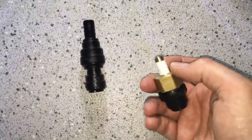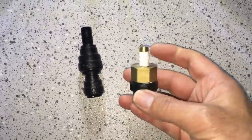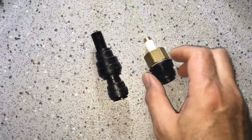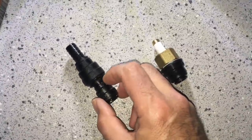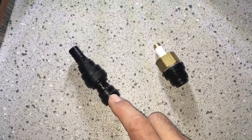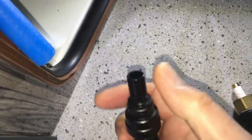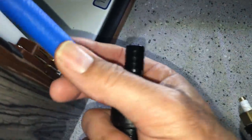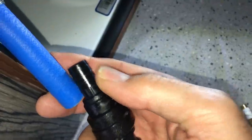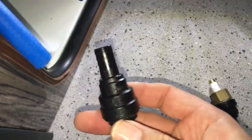The fitting I've just taken out had that bit of PTFE on the barb — that's where it was leaking from, not from the thread or the push fit fitting. So what I've got this morning is really two fittings put together: a 15mm push fit by half-inch adapter, and then a 15 to 12mm stem adapter pushed into that, reducing it to 12mm to match the LDPE pipe. This 12mm fitting should make a firmer connection compared to the previous 10mm one. I may have to put this in some warm water just to soften the hose enough to get this inserted, and I'm still going to use that fuel pipe clip because they are a better design than a normal jubilee clip. Let's get some boiling water and try that out.